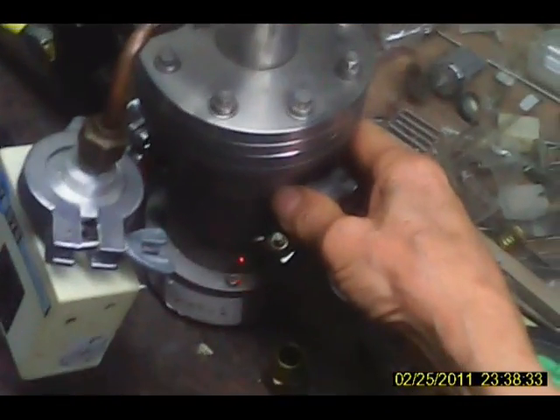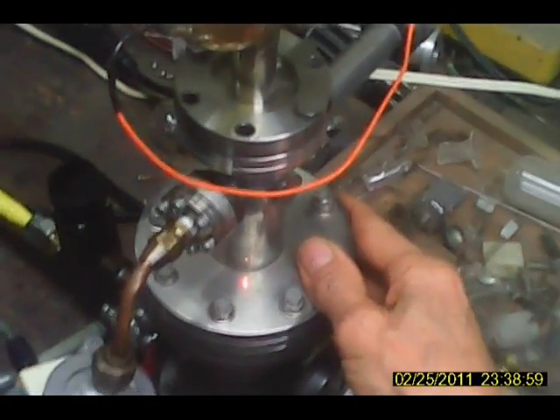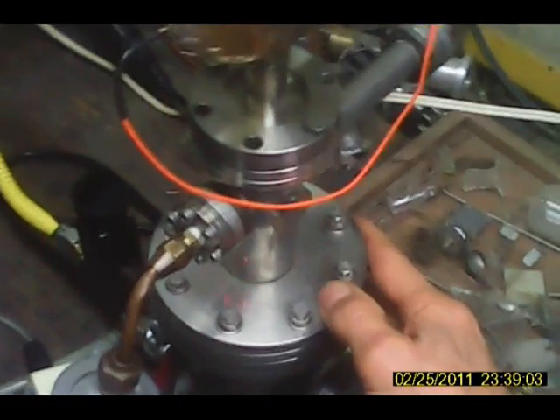We're going to test a turbo molecular pump. This is a small Balzers Pfeiffer German unit — one of the smallest they make — pumping around 25 liters per second. It's pretty fast but nothing like a diffusion pump. The main reason you'd use a turbo molecular pump is in an application where you cannot tolerate oil in the vacuum area. These have no back-streaming of oil like a diffusion pump — applications like semiconductor manufacturing, precision optical mirror coatings, lens coatings, where any oil at all would cause total failure.